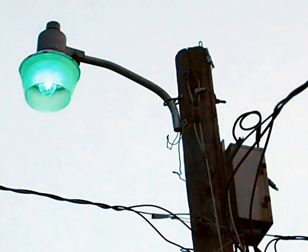Even with these methods, some UV radiation can still pass through the outer bulb of the lamp. This causes the aging process of some plastics used in the construction of luminaires to be accelerated, leaving them significantly discolored after only a few years' service. Polycarbonate suffers particularly from this problem, and it is not uncommon to see fairly new polycarbonate surfaces positioned near the lamp to have turned a dull, yellow color after only a short time. Certain polishes, such as Brasso, can be used to remove some of the yellowing, but usually only with limited success.